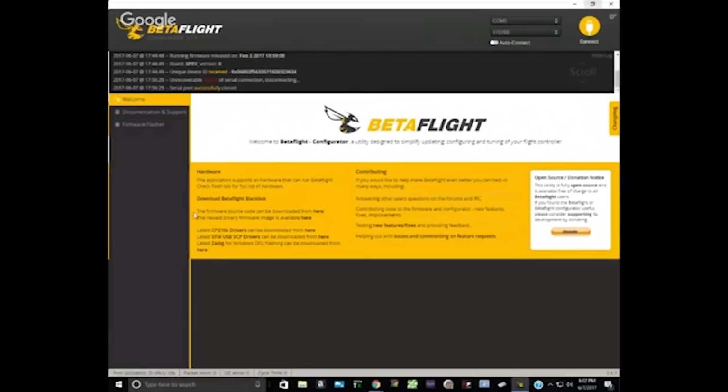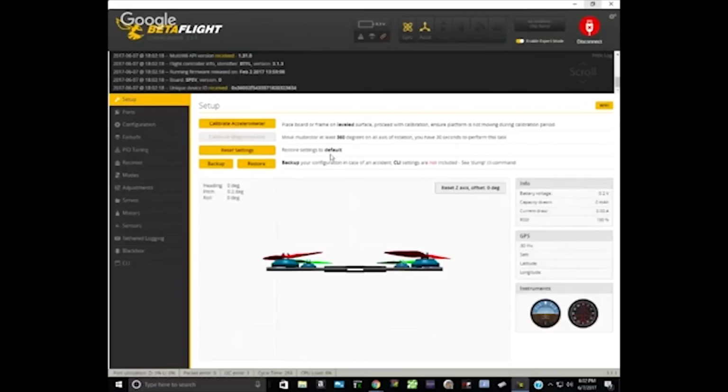And while you're doing that, I'll just talk over you. But min throttle should be what prevents the motors from ever stopping when the copter is armed. So min throttle is the minimum amount that the flight controller will ever send to the motors, and we need to configure that so that it's always high enough that they never stop spinning.